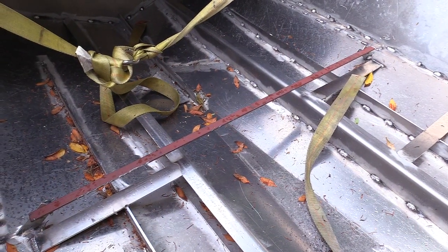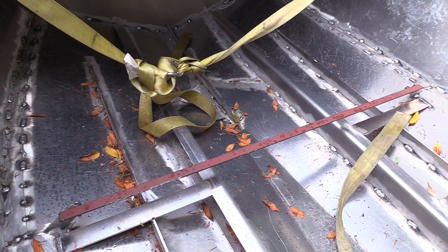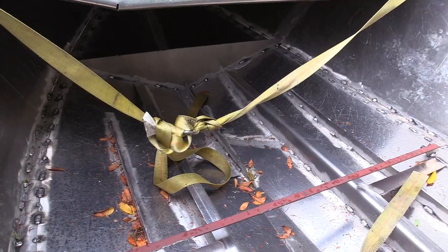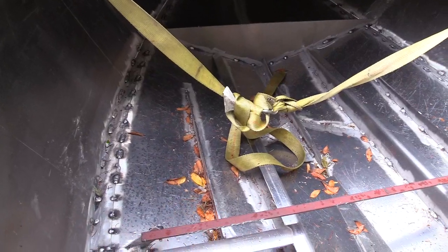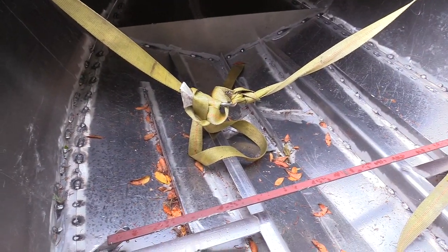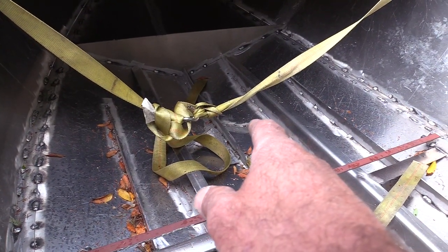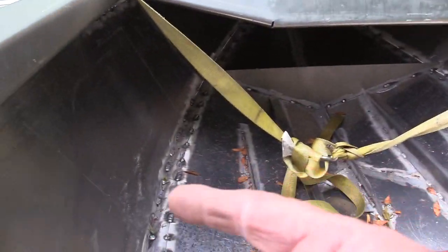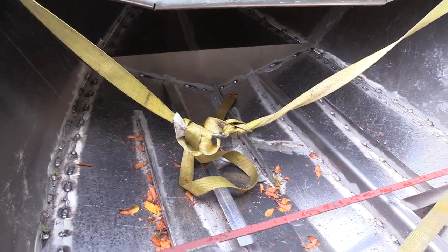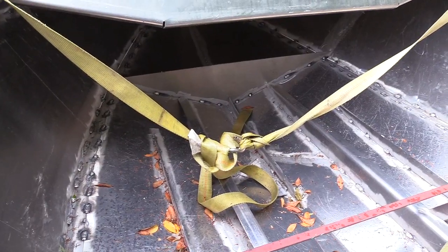Okay, then you set in your engine bearers. Or no, excuse me, you pull the front together, if I'm recalling right. So you take your outer hull panels. They're laying flat out in the front. You pull them together. You tack them to the front of the keel evenly. Okay, evenly in this case is higher on one side than the other, and between the outer edges, possibly an inch. Okay, so you pull your front end together. You just tie in your front end.